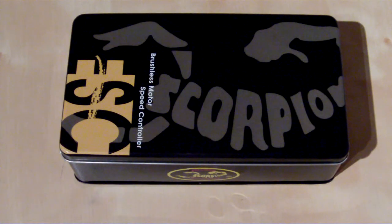Hey, this is Ashley Davis from HeliTuning.com and today we're taking a look at two new speed controllers from Scorpion Systems. One is the 90 amp HV Opto-Isolated Commander Series 50 volt ESC and the other is the 130 amp variation of the same ESC. These are HV ESCs with an operating voltage from 12 volts to 50 volts, or 3S to 12S.